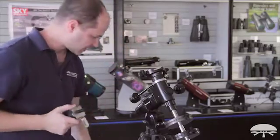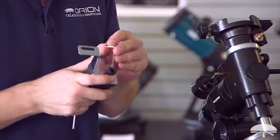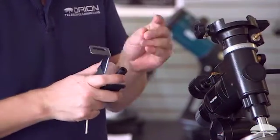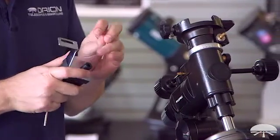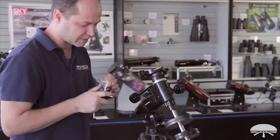On your motor shaft, you're going to want to use the other allen screw that comes with it and make sure the little coupler set screw is just loose enough so it allows the shaft to pass through without catching. Don't unscrew it too far, otherwise it's going to fall out — and that's a very tiny set screw and you'll never see it again once it bounces off the ground.